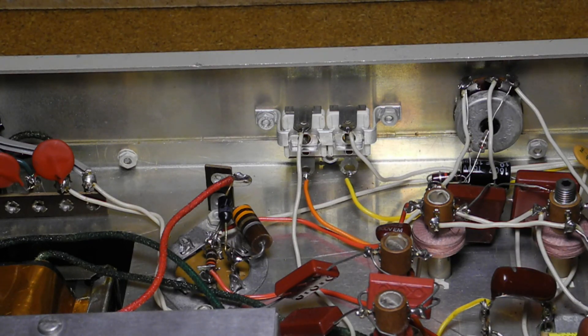I've seen similar issues with some other Heathkits I've restored, and this might explain why the unit didn't appear to have been heavily used. After alignment, I was able to pick up stereo signals on an FM radio with a test tone in either both, left only, or right channel only depending on the selected mode.